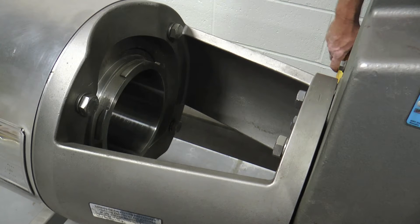For stainless tubes without chroming, inspect the tube surface for shallow score marks, gouges, or roughness. Minimal wear previously described can be taken out by honing the tube and then polishing. The grooving condition will only get worse over time, so frequent inspections will detect potential issues that can be addressed right away.